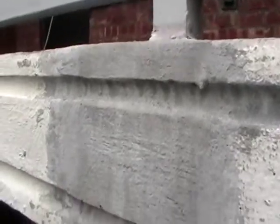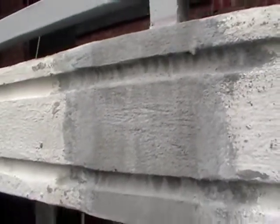Another crack on the 9th floor unit above. The crack on the floor continues to the curb. This crack continues to an area on the fascia which has already been patched and repaired, and is visible on the underside of the slab.